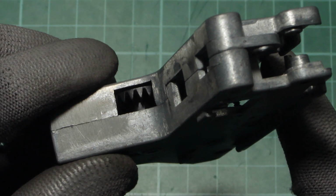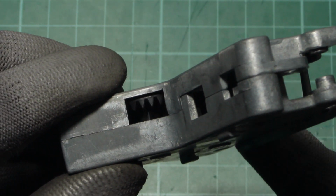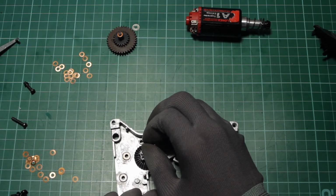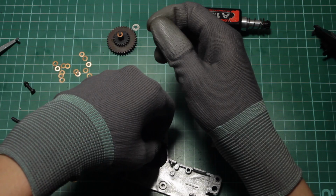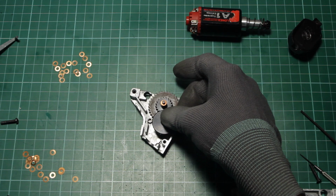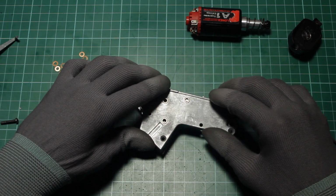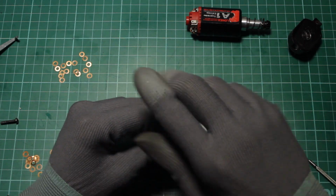Now that the motor height has been set up, and the top face of the bevel gear has been shimmed, the other side of the gear axle needs to be filled to stabilize the gear. Following the same process on the spur gear, add thick shims to fill up space, and swap out the last shim for a thinner one if it gets too tight. You can also verify your shim job by closing up the gearbox shell, adding fasteners, and checking if the gears still spin freely.